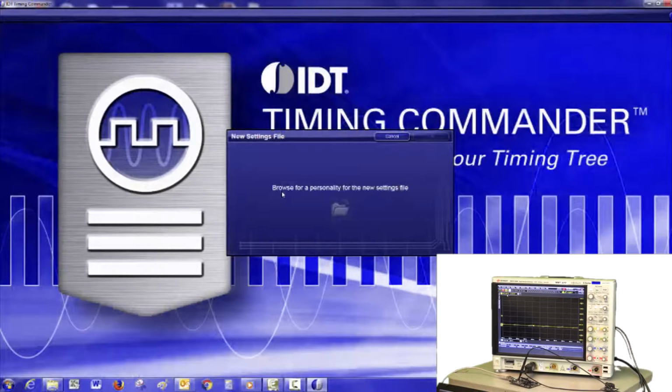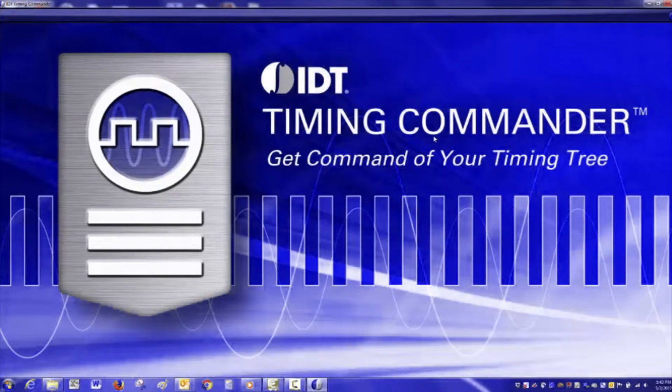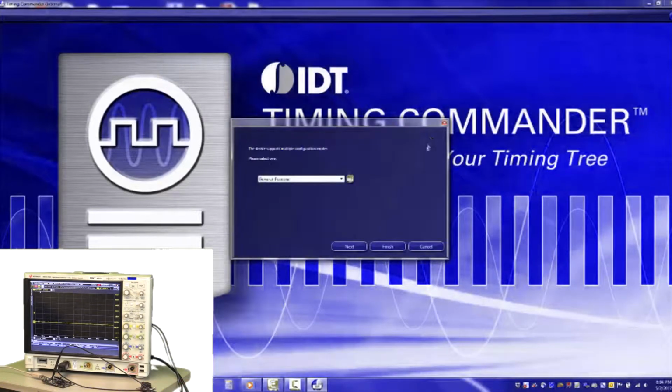And the next thing it will ask you is what product in the product family. I will select the 5P35023 because that's what's on my evaluation board. And now timing commander takes off and tries to set up the desktop. It asks you one more question, like what type of configuration you want to build. By default it pops up with general purpose, and that's what I will stay with for this case.